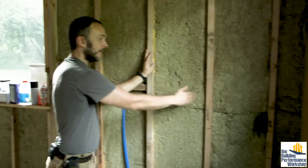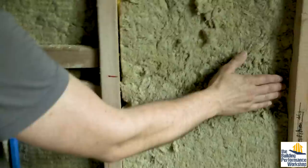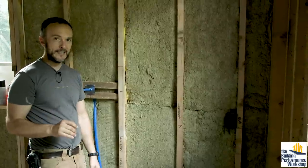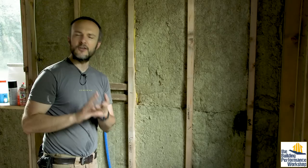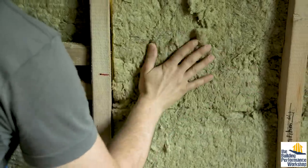That's how you start to analyze where you're spending your money, making sure you're not putting money where it's not going to work. Heat follows the path of least resistance. The insulation inside the cavity should be at a consistent level — there should be no gaps anywhere, zero. There should be no compression. If I tuck this insulation in and squish it, that hurts it, because the main ingredient in insulation — whether you're buying Rockwool, fiberglass, cellulose, sheep's wool, or spray foam — is air bubbles. Make sure it's all nice and fluffy and the air bubbles are given their space.